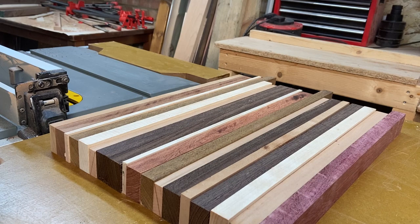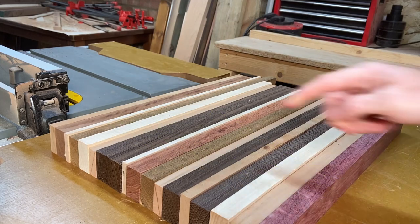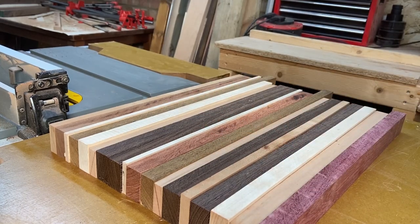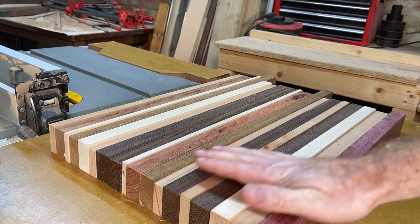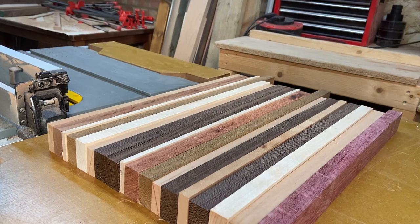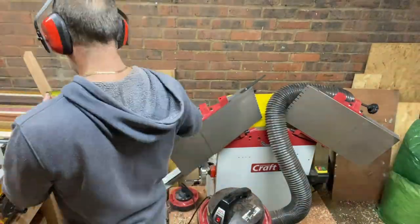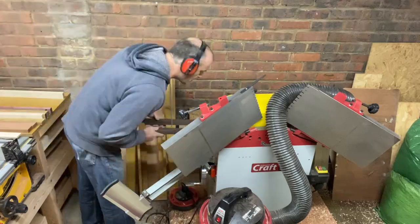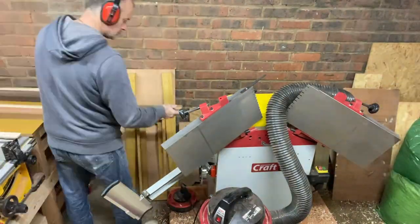That's basically the board. It's currently a little bit wider than I want — nearly 13 inches wide — so I need to trim these down a little bit. Some need to go through the thicknesser to be brought down. Then I'm going to cut all these to the right height because they're a little bit uneven at the moment. I want these all the right height before the glue up, so a bit more work to do. The next step is getting these through the thicknesser to get them all exactly the same height, so there's less work to do later.